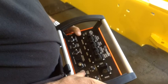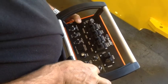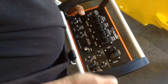To start the engine, make sure the parking brake is applied. This is done by pressing on the button titled park brake. Then push upward on the knob titled engine start and hold momentarily until the engine starts.